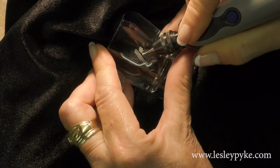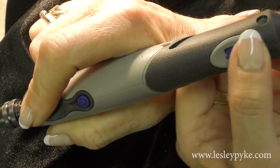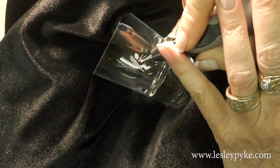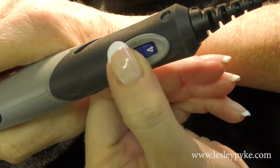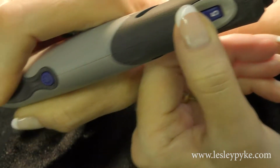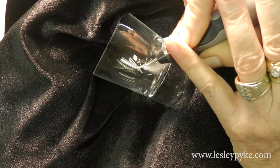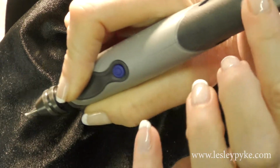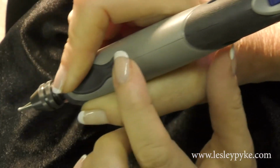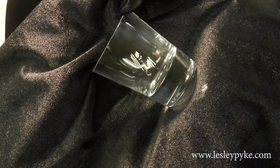But as you can see, it's a lovely sharp diamond anyway, of course, brand spanking new. It was coming up fine. Took it down to 2. Works perfectly all right on 2. Took it up to almost 5. And of course, engraves really nicely. But as the demonstration showed, it doesn't need to be 5. I think 3 is probably fine. 3 or 4.